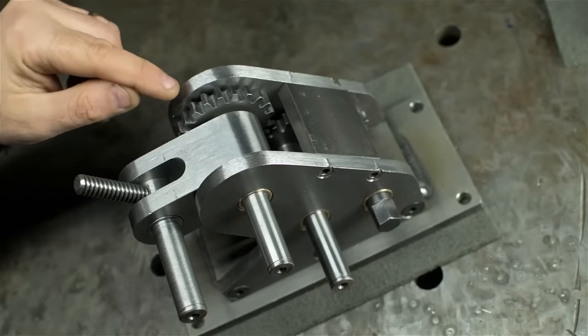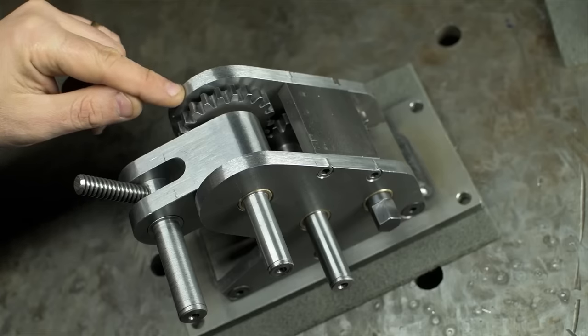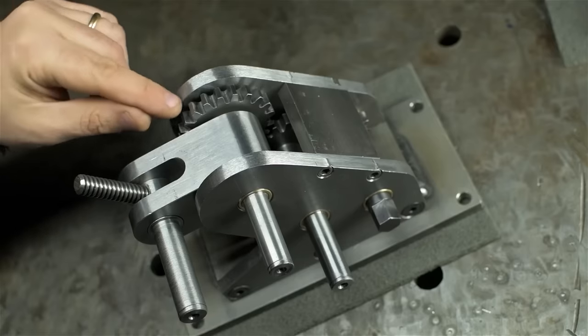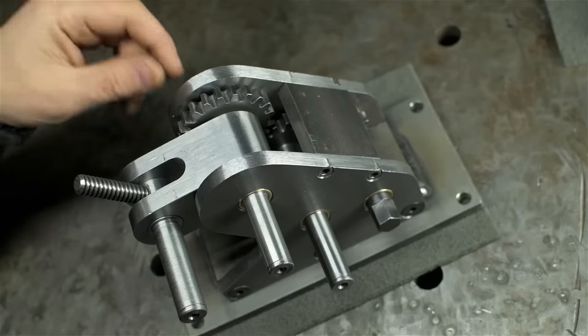The biggest culprit seemed to be the tooth I had to repair with the TIG welder, where I had the hole in the tooth. It looked good, but I guess close enough here can be too close. It was that one, and then there were a few other oddball ones. Filed the interference out and then just wire brushed them all again.